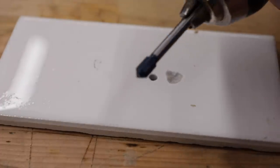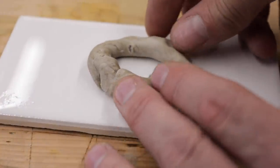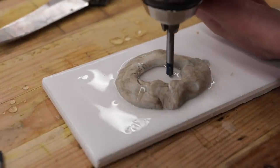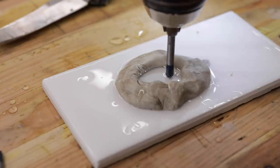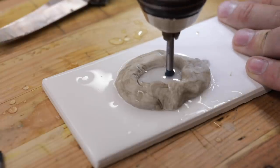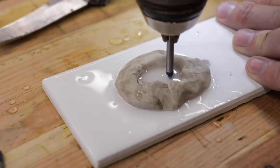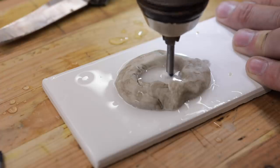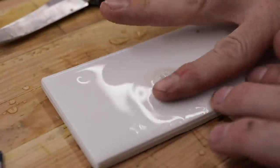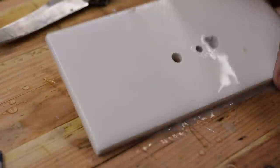I've got the quarter-inch size chucked up, so we'll go with that. Let's make our little water dam — it makes a lot less mess than the other way. Let's go with the Bosch bit. Sounds different. Very precise — it didn't wander. I feel like if I had a little Sharpie mark on that tile I could put that point right on there. And yeah, it went right through. That actually worked really, really good. That is a very precise, clean hole.